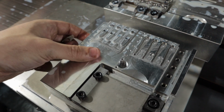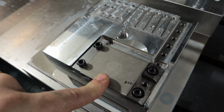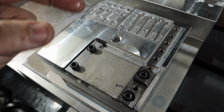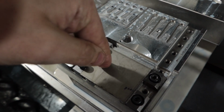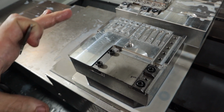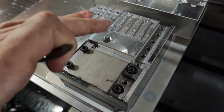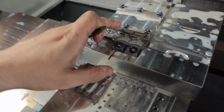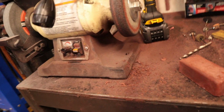That's a really quick rundown, but I will say drill a lot of holes and contour with end mills like slotting, and don't ramp your end mills. Just drill a hole and then stick the end mill in the hole and then ramp with the side of the end mill. I found that increases tool life like crazy, so that's the technique I've been using on these. So I drill a lot of holes, and it works really good. That's also what I'm doing on the lock bar inserts for the knives, but that's a whole other video.